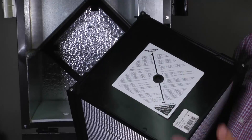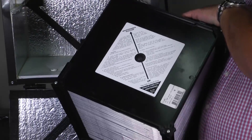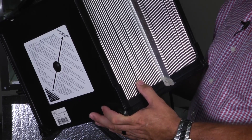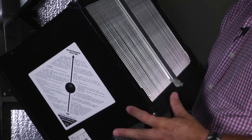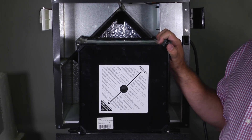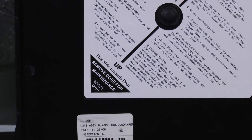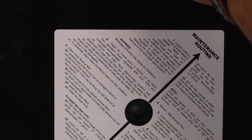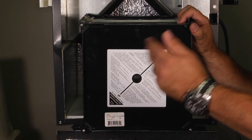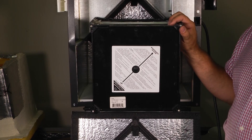The air that I'm putting outside in the wintertime, we've already heated that with our gas furnace — I don't want to just waste that heat. So by taking the cold air and passing it across the same channel as the warm air, I can exchange the heat I've already put into the house and actually warm the air that's coming back inside. The nice thing is that in the wintertime we can also reduce humidity inside the house. The colder it is outside, the less water is in that air. So I take that dry air, bring it inside, pass air across it to heat it back up without changing its humidity level, then mix it back into my house and the overall moisture content inside my house goes down.